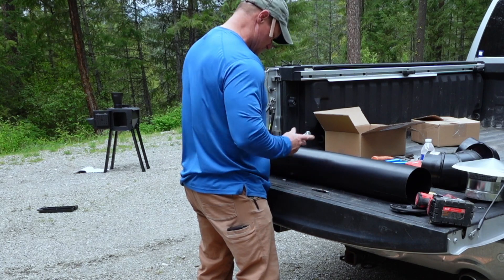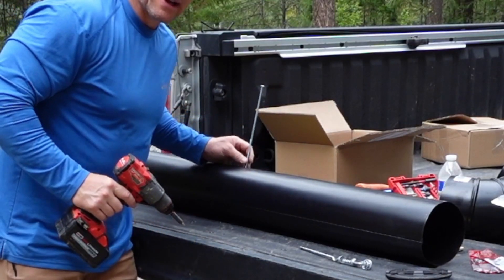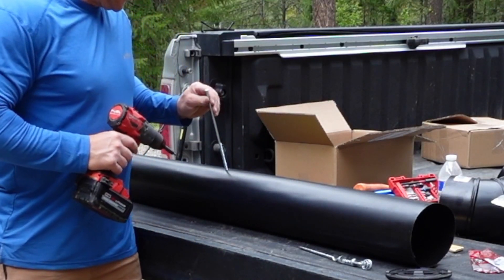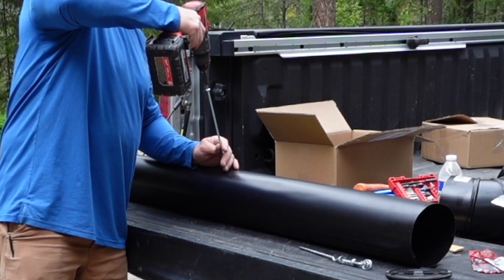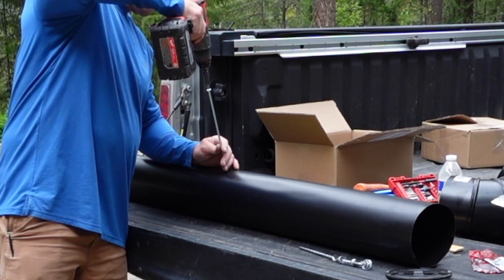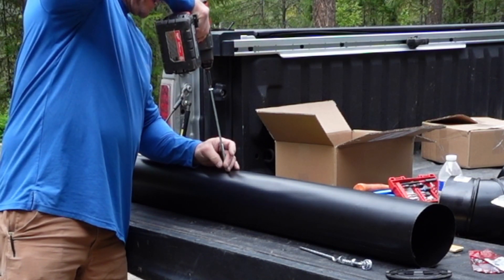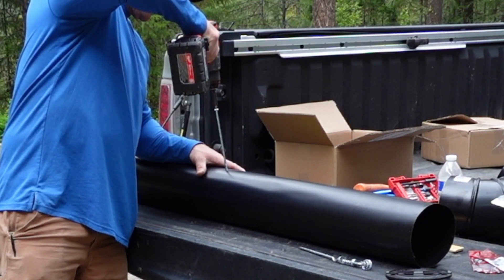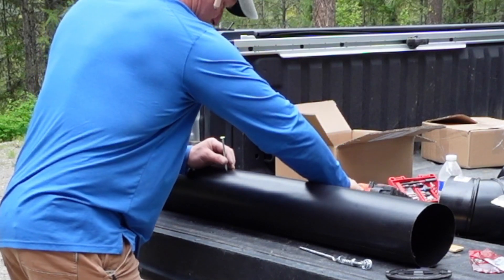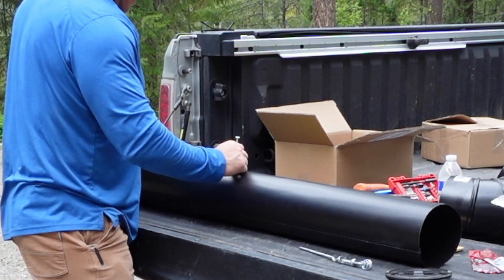I found a large machine screw that fits through the hole diameter. I'm going to press it through to make a dimple on the other side - that'll give me a good center spot to drill my hole for the damper rod. Then I can drill the holes the same diameter as the damper rod on both sides.